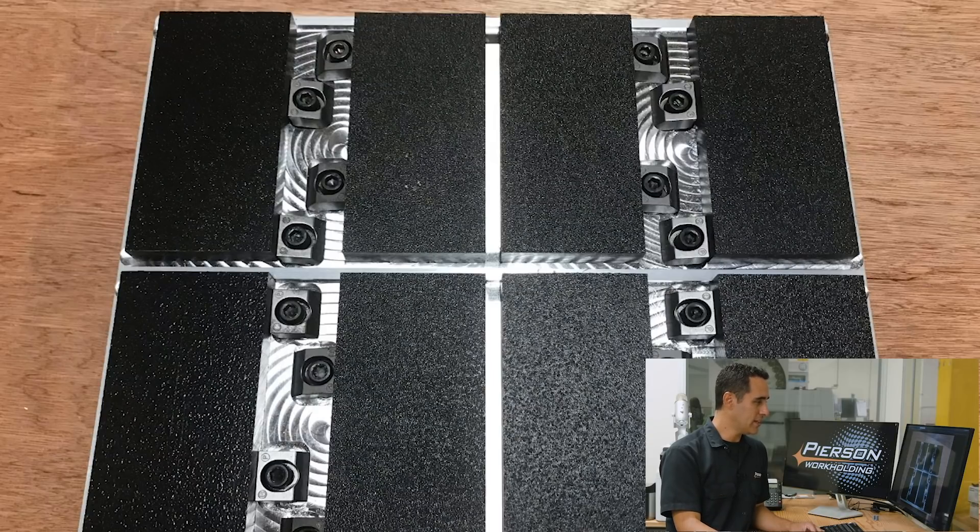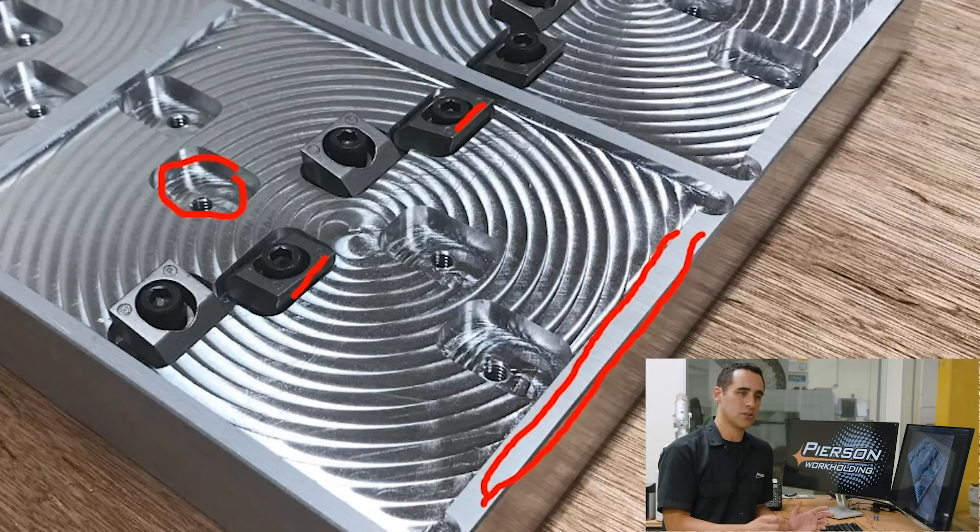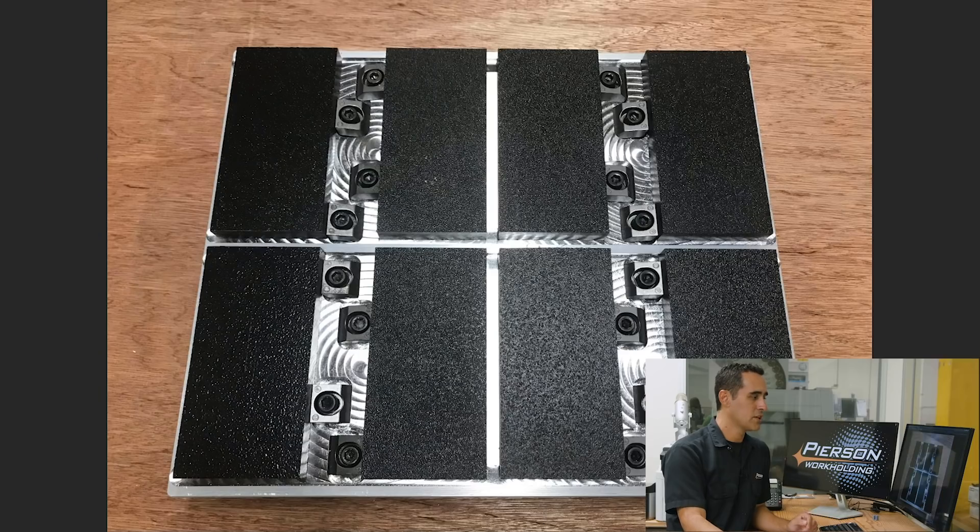With his work pieces in place, you'll notice he's got about three-eighths of an inch of material along these edges — and that's perfect. I get that question a lot: how much material is enough to make a secure hold without deforming the pallet? If you are using our pallet system with three-quarter-inch-wide pitbull clamps, you need at least half the width of the clamp. Three-eighths on a 0.750" clamp is fine. If you're using half-inch clamps, a quarter inch is fine.